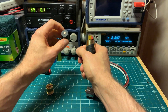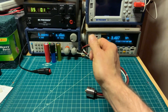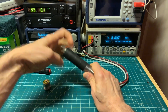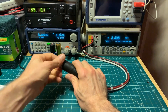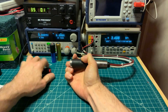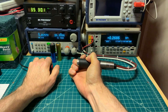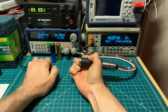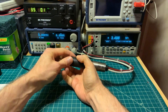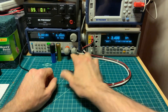I would expect that, because that's what I see with the other mechs and their adapters. It's such a small piece of metal that there just isn't a lot of resistance, and it's copper too. Let me go back and throw the stainless steel on to see if I got lucky with how consistent it was. Moving around the button presses a little bit — readings of 0.25, 0.27, 0.27, and about 0.27 — so that's pretty well stayed the same.